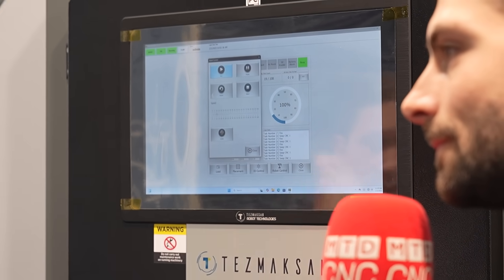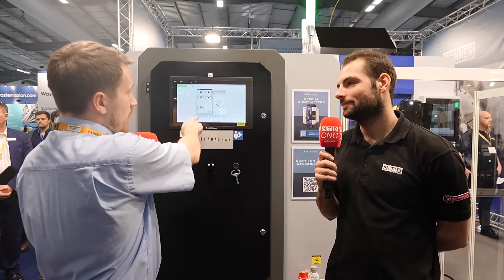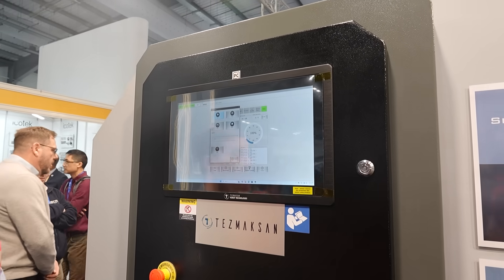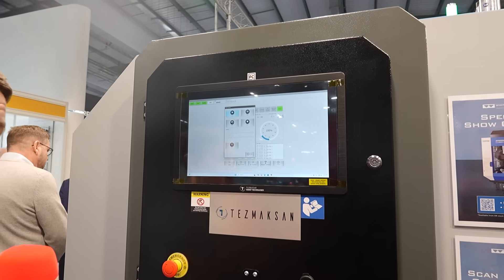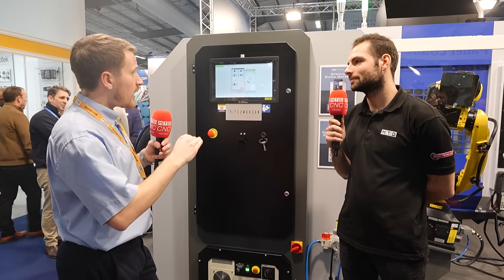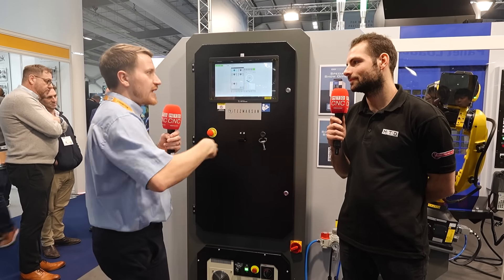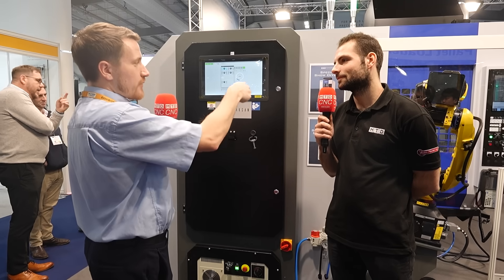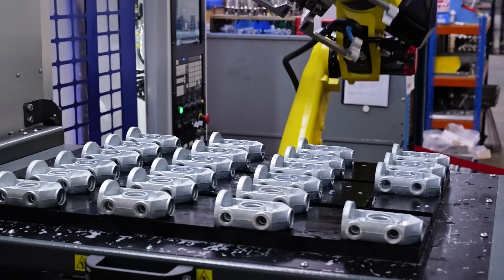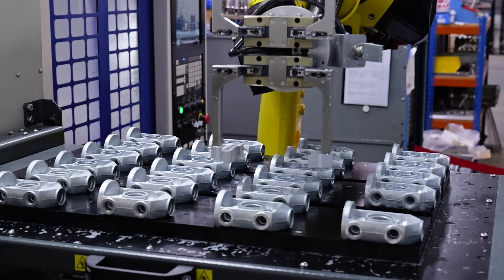When going over the trays on the placement, you nominate the DXF suited to the component — that could be a casting of some sort of shape. The DXF has the nominated origin in the X and Y plane, which creates the flatness and determines the positions and pick positions. Once it's taught and in place, you don't have to keep re-teaching the robot. You load the template to the datum, and that's it — load the right program, run it through, and the robot tells the machine to select the correct running program. Then it's just loading and loading.